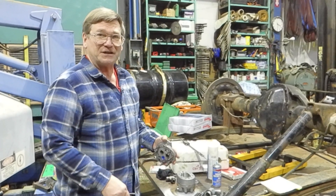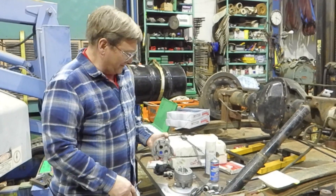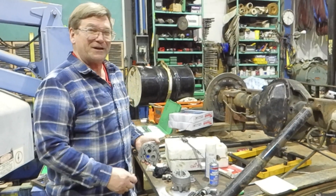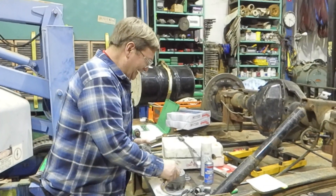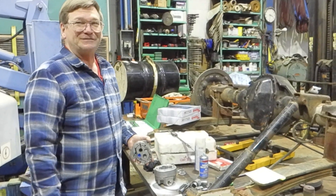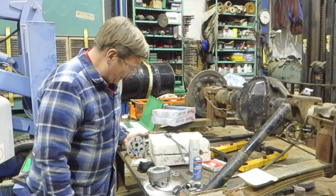They burned up three pumps before I got a chance to look at it. I had to look at the specs a while because it all looks okay, it's kind of small here, but you start looking at what the pumps were supposed to do and you're like, no, there ain't enough oil. They made a bigger hole in it and put it back in. The next one they built — these were all new pumps — they bored a bigger hole in it, and everything was fine then.